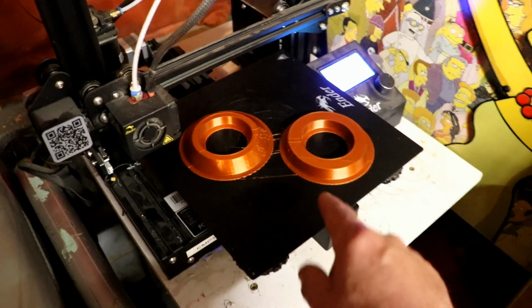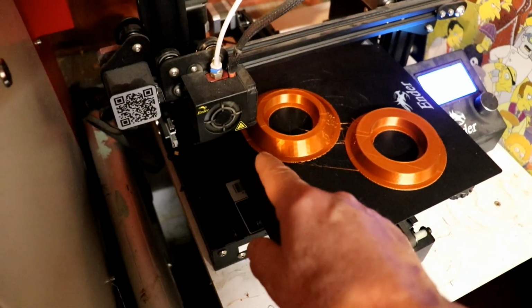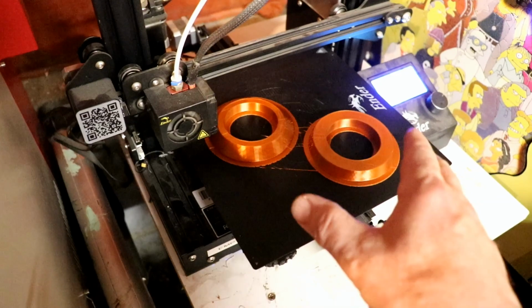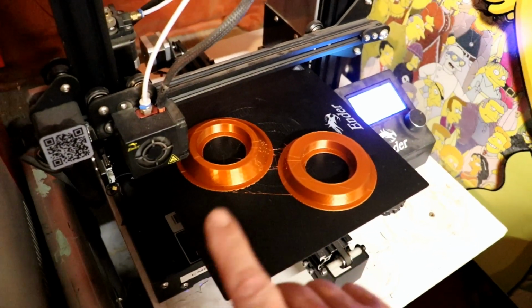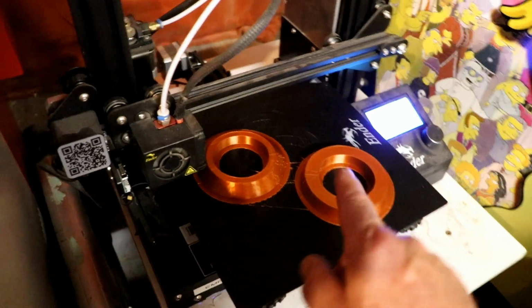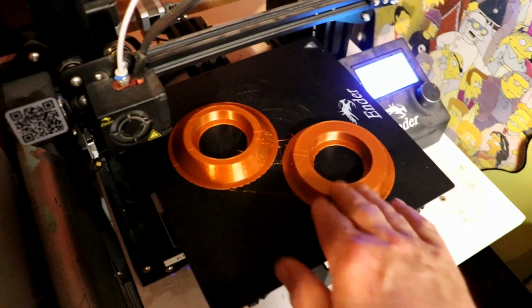Before I started doing all-nighters with this, I did actually unplug the temperature sensing thermistor to make sure that it would recognise that, see it as a fault and switch everything off, which it did, because early models apparently didn't, and if the wires broke or something, it could lead to a rather unpleasant thermal runaway.